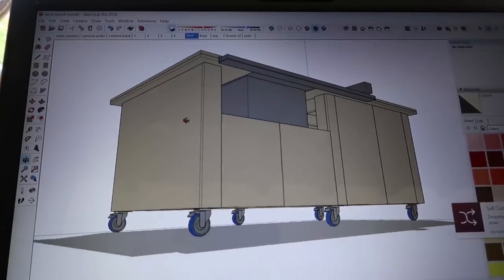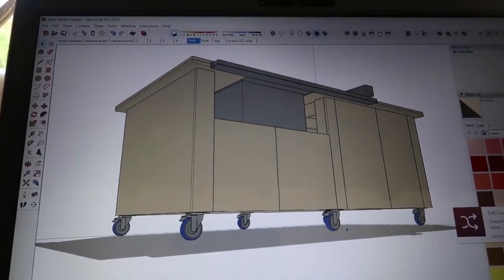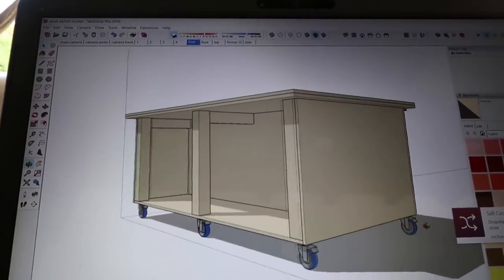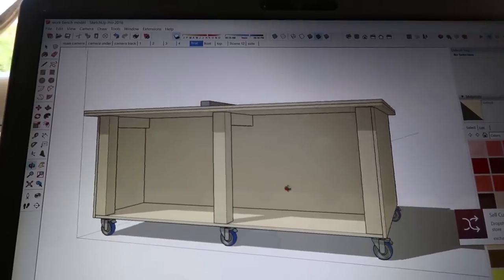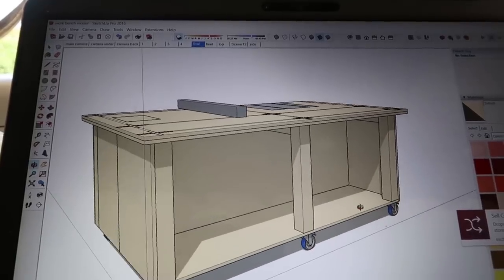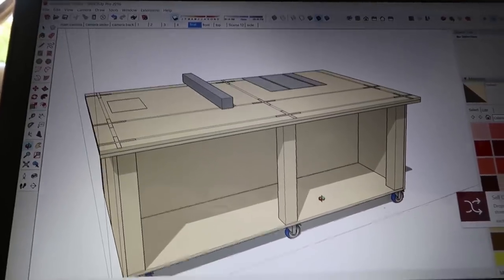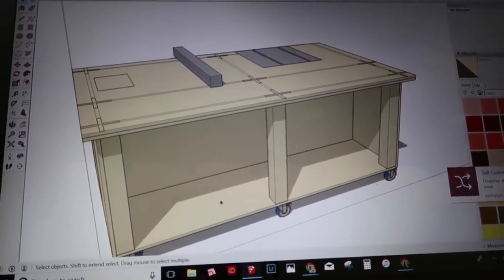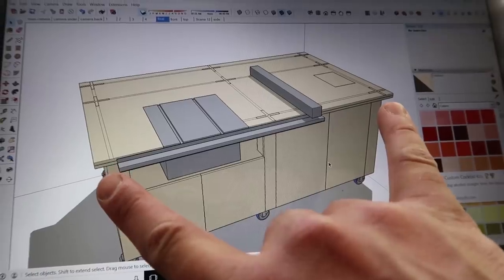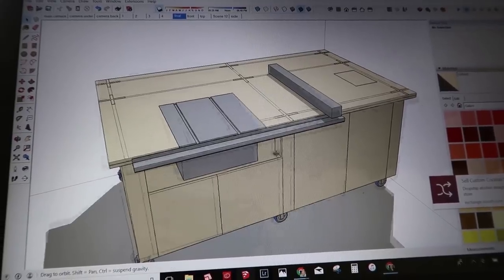It's about 36 inches tall. I built it on casters — four locking casters, and then two regular swivel casters in the middle. On the opposite side of the table saw, I've got a little place where I could put my feet up. I'll have some benches stored underneath so if I'm working with my girls or with Cassidy, we can have little benches to sit on and work on projects. The table is seven feet long and four feet wide — a four by seven foot table.